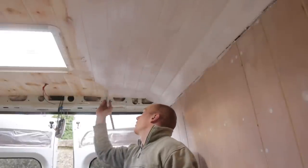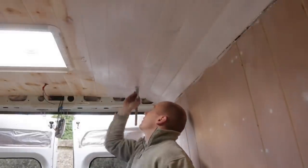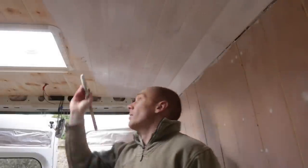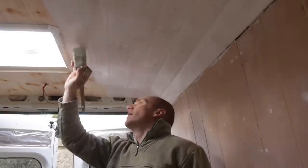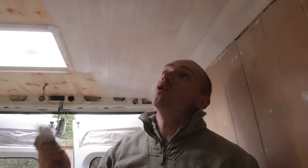The other thing, if you didn't tongue and groove like this, and you know what colour your ceiling is going to be, then you can pre-finish the boards, and we've done that in the house. So maybe in the summer, when the boards shrink a little bit, you'll end up with a little hairline gap down there, and you can get away with that if you already paint the tongues white before you fit it.